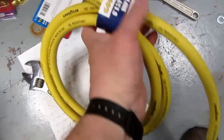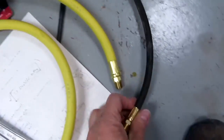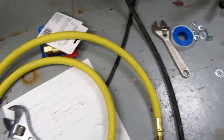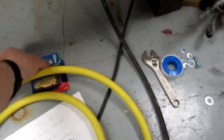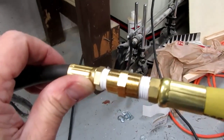Here's the hose whip — a 6-foot length of 3/8-inch rubber whip hose, Goodyear. I'm going to use it to extend the whip hose on the hub of the hose reel, and that requires a quarter-inch female-to-female coupler, which I have here. At the end of the hose whip I'm going to have a male quick disconnect, and at the other end a female quick disconnect. There's the air hose whip-to-whip coupling, the male quick disconnect, and finally the quick disconnect on the end of the air hose.